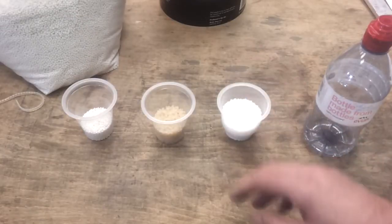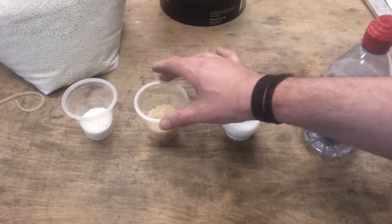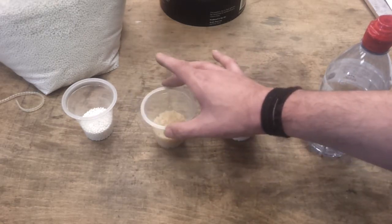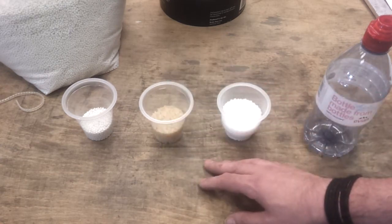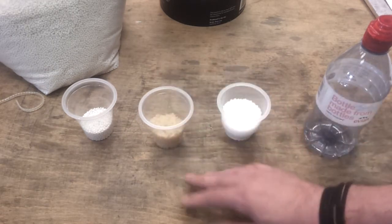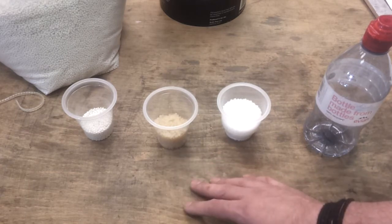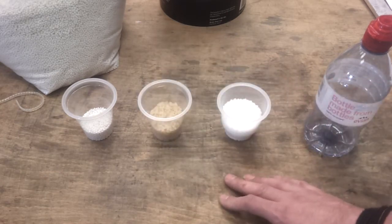As well as polycaprolactone, I did look at a few other materials. This is poly-3-hydroxybutyrate (P3HB). It's relatively commonly available — actually identified in the 1920s, but not industrially produced until ICI showed up in the late 70s. It's difficult to make, relatively weak, and it's never really caught on. This batch was produced by a company called Ecoman over in Shenzhen. It is quite tricky to mould — you have to keep it below 120 degrees, otherwise it basically turns into a sticky syrup which sticks to everything and smells really badly. But it does have a few useful properties as well as being biodegradable in the environment.